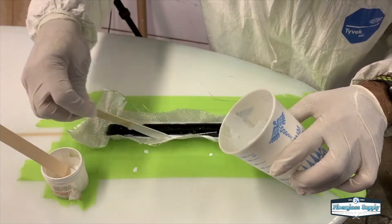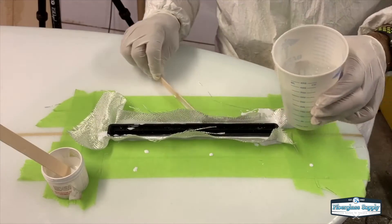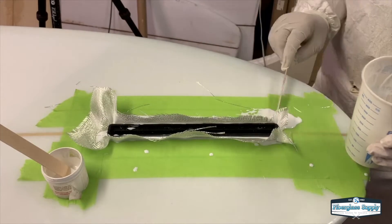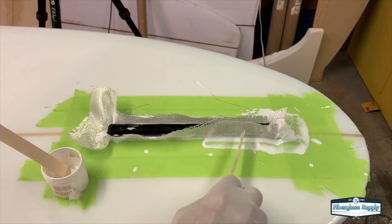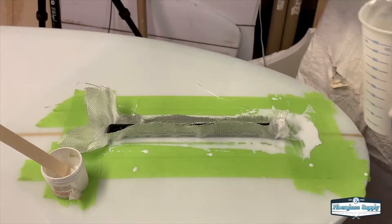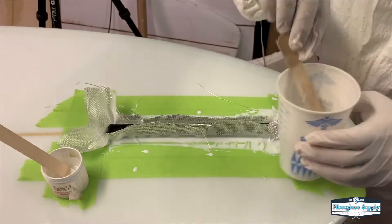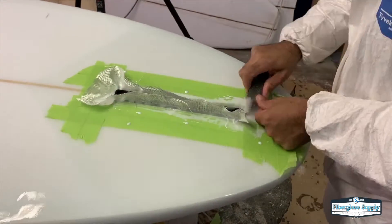What I'm doing here is going around it putting a little bit more resin on there. As I said, the fabric will wick the resin and hold it in place — over on the back side I'm cleaning up some excess. You probably want to put a quarter inch or so of resin in the bottom of that hole before you push the box in. Make sure you get enough resin wicked up on that fabric so that it's above the top edge of the box, because later we're going to come in with a razor knife and trim that. If there's dry fabric, the problem is if we try to grind it, it's going to dust up and cause issues.